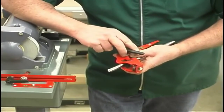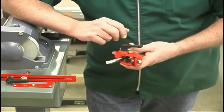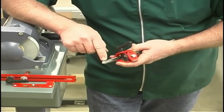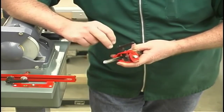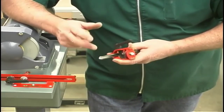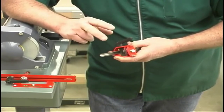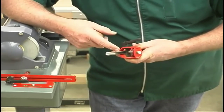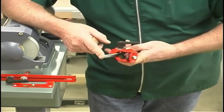Setting up either the True Grind or the Vari-Grind jigs is basically the same. I often see someone with a big cheek ground out of the side of their bowl gouge, and I ask them why they have that big flat cheek on there. They tell me it's because that's the dimensions they were given. If they read closer, they would see that it says the dimensions are a good starting point. Normally it's anywhere from an inch and three-quarters to two inches — it could be an inch and a half, whatever suits you.